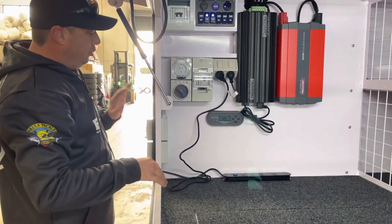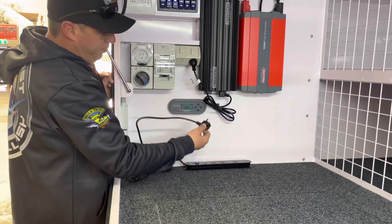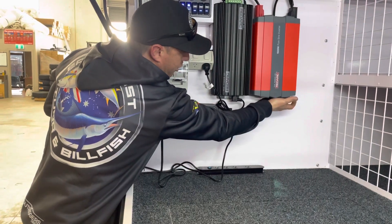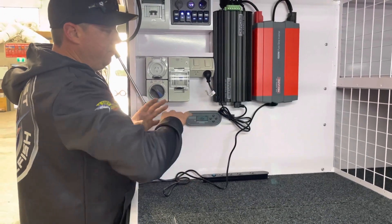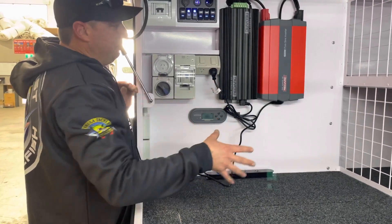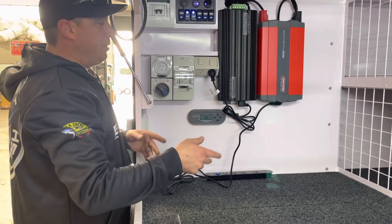Now if you're on site and you do not have 240 but you still want to charge all these battery systems, it's as simple as unplugging the switchboard with all your chargers in it and plugging it straight into the bottom of the inverter. Switch the inverter on — that will then charge all your battery systems, your 12 volt tool system, off the batteries of the trailer. So you're basically an independent setup. This is a hungry machine, so we're converting 12 volt power to 240 volt power, so this is something you might run for half an hour, charge all your batteries, then turn it off.